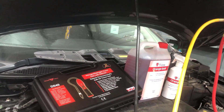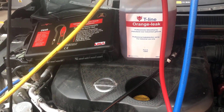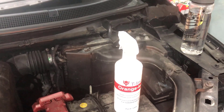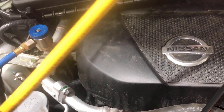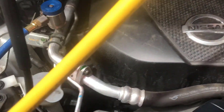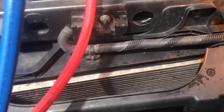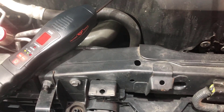There are a couple of different ways to find the leak. You can use the T-line orange leak detector spray around all the different areas or suspected areas — if there's a leak, it'll start bubbling. That works well in areas you can visually see, such as behind or in front of the condenser. However, it's not ideal for areas between the condenser and other components where you can't get the sprayer in.